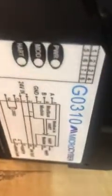That covers the RS-485 part. Now for the HART part — we are going to give just two connections, on terminals 9 and 10 as shown in the figure. Terminal 9 is positive and terminal 10 is negative.